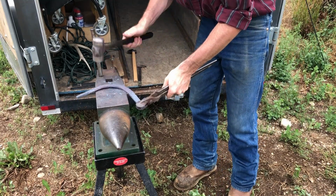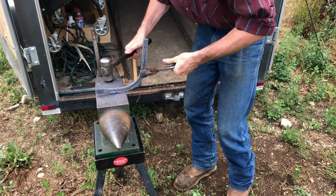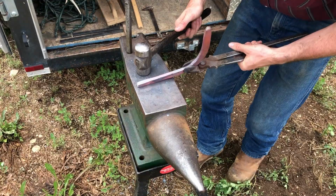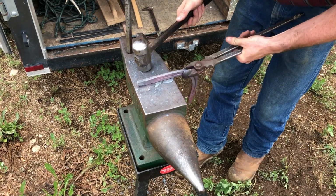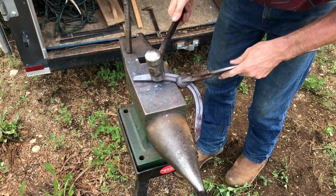Now throughout this whole process, you're going to see me leveling the stock and flattening it out. And that's because if I have it all uneven and unbalanced, it makes it really hard to make effective decisions about where things need to change. It's really hard to see where your fuller needs to be, how your heels might need to change, your nail holes, if you're working with uneven stock. So I'm constantly leveling as I go, reflattening that shoe.